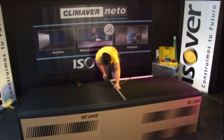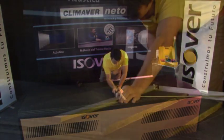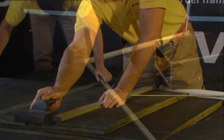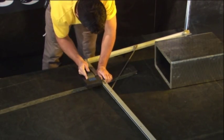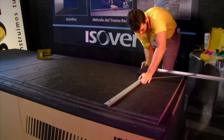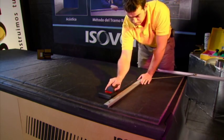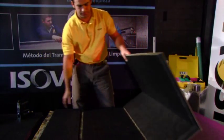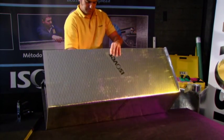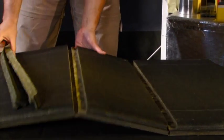KlimaVair MM tools have been especially developed for cutting the inner lining of KlimaVair duct boards and are fitted with high-quality and easy-to-replace steel blades. The KlimaVair MM tools are used to produce cut grooves with a chair-shaped profile, which allow the duct boards to be folded at an angle of 90 degrees. This produces all the joints from a single piece of board. The glass wool is removed by hand as the groove is made.